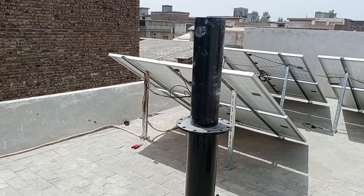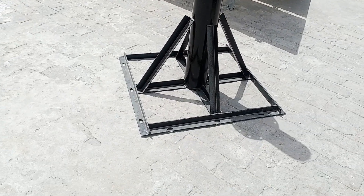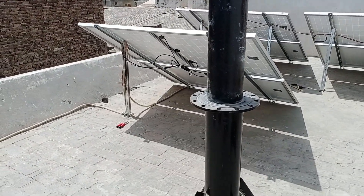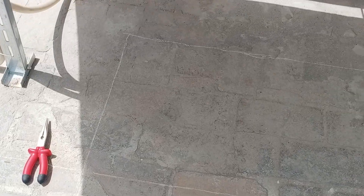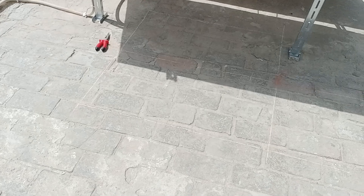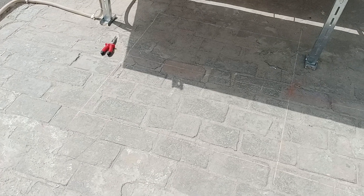We will show you how we have started the work of upgrading the solar panel. Here you can see the stand we have built, which will be installed here. This entire system will be rotational. We will show you each and every detail, including how we installed it on the roof and how we completed the work. We are placing the solar panel above the wall rather than in the center of the floor, because it has a significant weight — around 300 kilograms or more — so we're positioning it directly on the wall to support its weight.